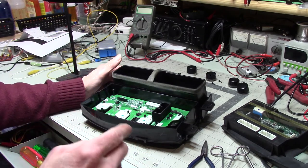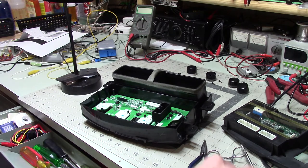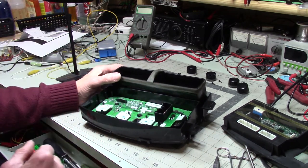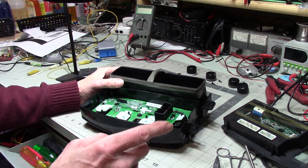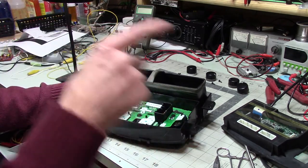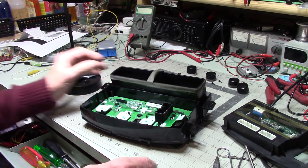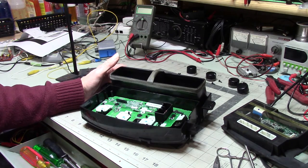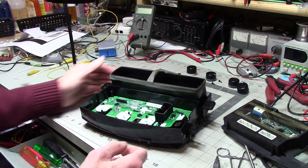So there's two advantages to that. Number one, the switch on the dash can be a lot less bulky, and the wiring going to it can be a lot thinner. Those are both two pluses. And then that switch actually connects to a solenoid or a relay, depending on the design. So, for instance, you have a Ford, you have a relay, or used to, that then activates the solenoid on the starter.